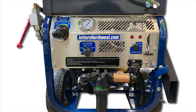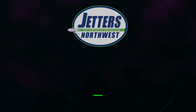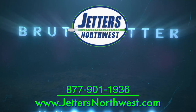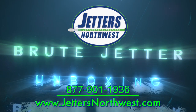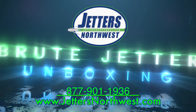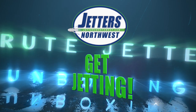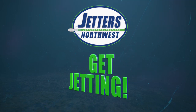Lastly, let's look at the water strainer, which is in the middle down at the bottom — that's the black T-shaped item. This should be cleaned at least once a week, if not daily, and definitely after about 10 or 15 minutes of your first run. This unscrews by hand and is fairly self-explanatory. Thanks for taking the time to watch this Brute Jetter unboxing and setup video. If you have any questions, feel free to contact us here at Jetters Northwest or reach out to your local dealer and service center. On behalf of Aaron Daniker and the rest of the Jetters Northwest team, this is Steve Jones saying thanks so much for your business and get jetting.